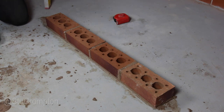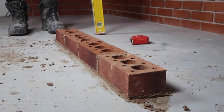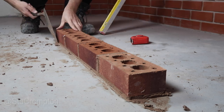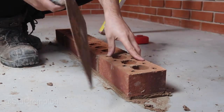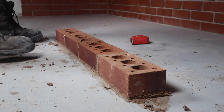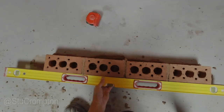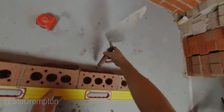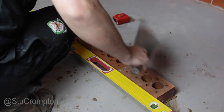Now what we're going to do next is range them in. Basically, ranging in is just using point A and point B to create a straight line — it can be done with a level or a string line. I'm going to find my pencil line. Now let's put our level on it and range them in. You can see there's a gap here, so we need to knock these two bricks out to the straight line or the level, and that will ensure that all these bricks are matched up and in line with each other.